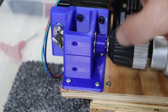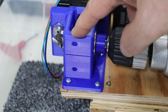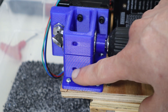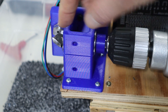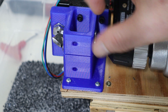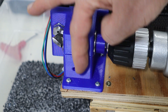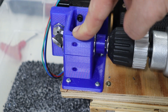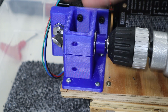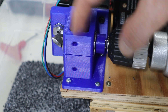At some point I think I'm going to turn this into a metal part that's milled. For the moment, what I'm going to do is make this in two parts held together with bolts and screws — one part with lamination lines as you see it here, then another part going this way where the lamination lines are perpendicular. That means it'll be strong in both axes to back this up and keep it from delaminating, at least until I have a chance to mill a version out of aluminum.